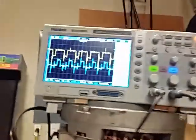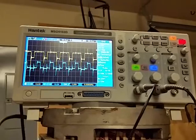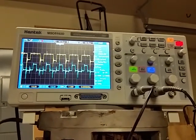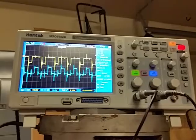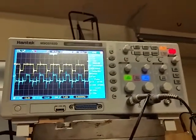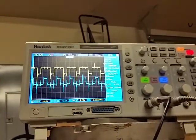I have the inverter speed limited right now with a parameter called Fmax, which is maximum frequency. The only reason I did that is because this motor would just try to ramp up to some ridiculous speed now that it has the encoder connected to it. Because it has the encoder connected, it can now utilize torque mode, and so when you command the motor to start spinning up, it's going to fly — so much so that it will pop an 80-amp fuse with no hesitation.